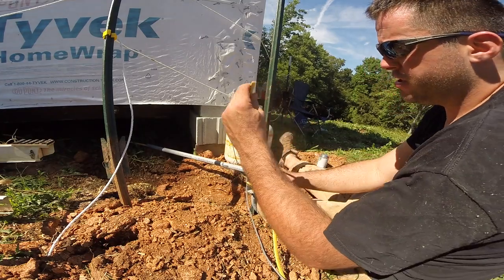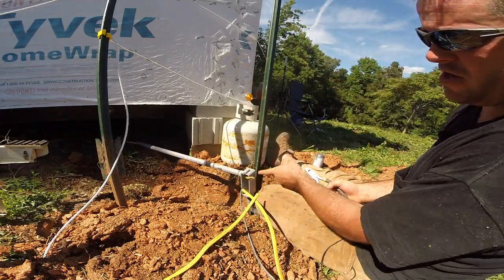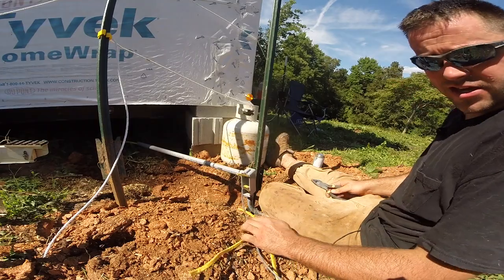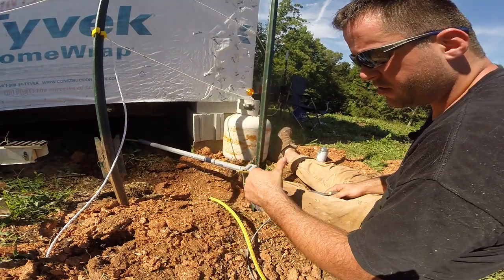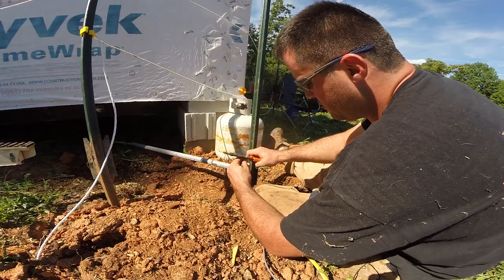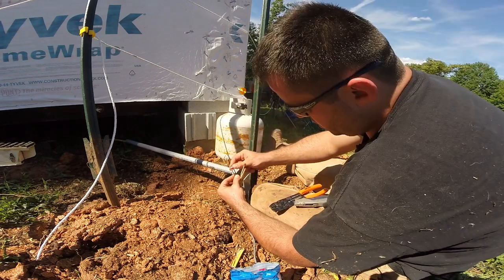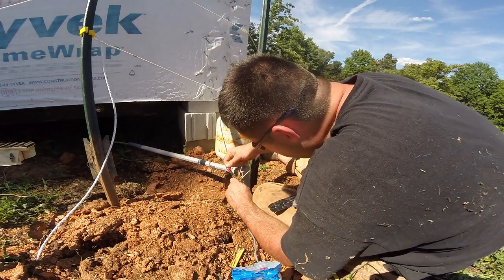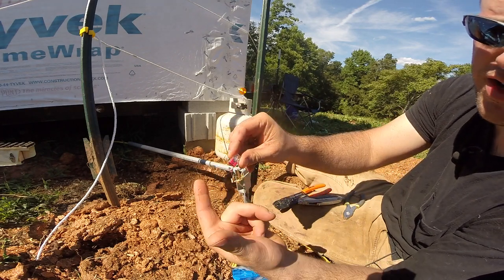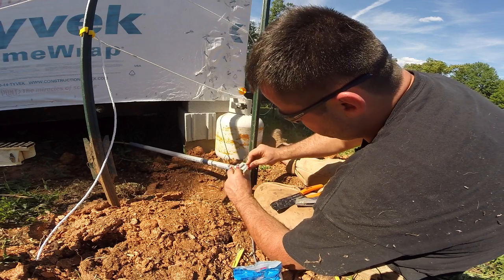So that line's now coming out of the house. None of this is live - it's all safe to work with. So I can cut these. Typically when you're coming out of a box you only need about 5 to 6 inches to work with. I'll cut both of these to length. Now this Cat5 cord - I've got another 30 feet that goes that way and I'm going to run it through this pipe and into the house, into my crawl space as well. I'll strip all these to a half inch. I have some of these new-age wire nuts - basically you just stick the wire in and it locks in. There's no twisting and it's foolproof and it doesn't come undone unless you disengage it.